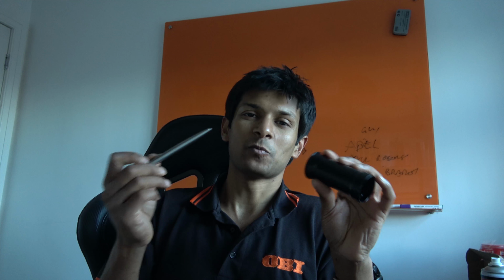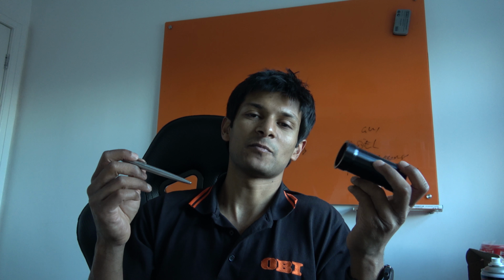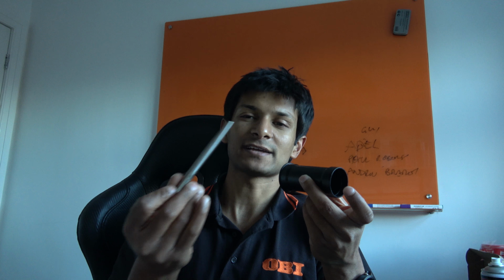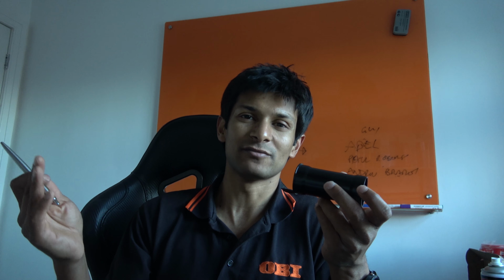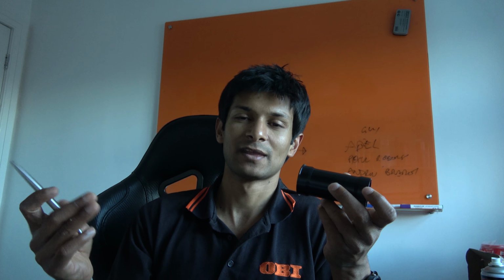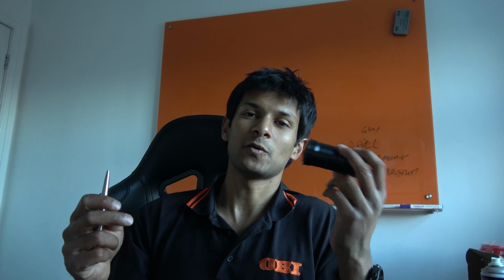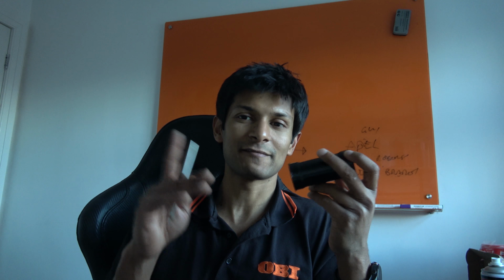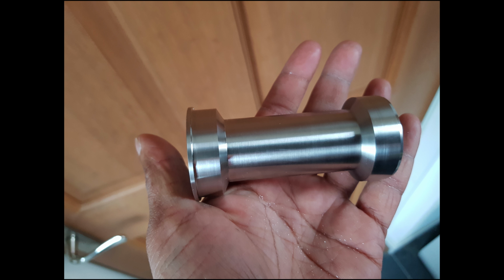Thin walls, you need to have thin walls, because otherwise you make the bottom brackets heavy. With the thin walls, and if this pen represents the cutter, as you push in, it's deflecting the material. The combination of all of these makes it technically difficult. So I'm not going to go into the actual way these things are held, but that is one of the differences between, I guess, my bottom brackets and everybody else's, because I only machine from one side, irrespective of what material it is.